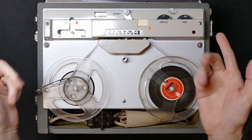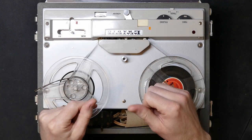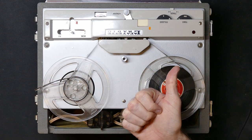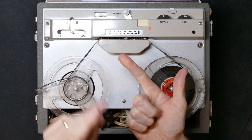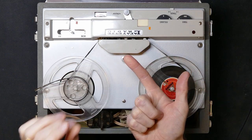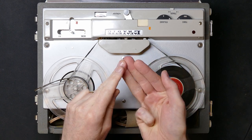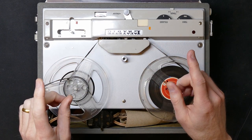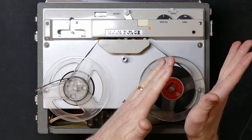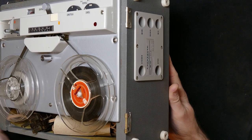That current is then amplified to be what we think of as sound. Because the read head is passive, you can add the amplification somewhere else — you can take the signal out from the read head, connect it to an amplifier or a mixer, and get the sound out without having the recorder plugged in to power. On a reel-to-reel recorder, the power goes to the drive mechanism — the capstan — and to the record head and erase head. But the read head itself doesn't need power.